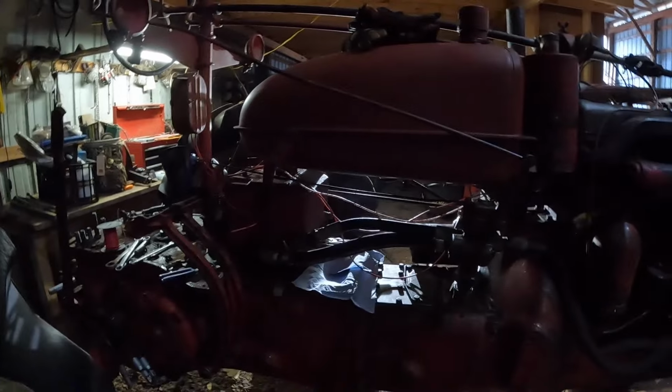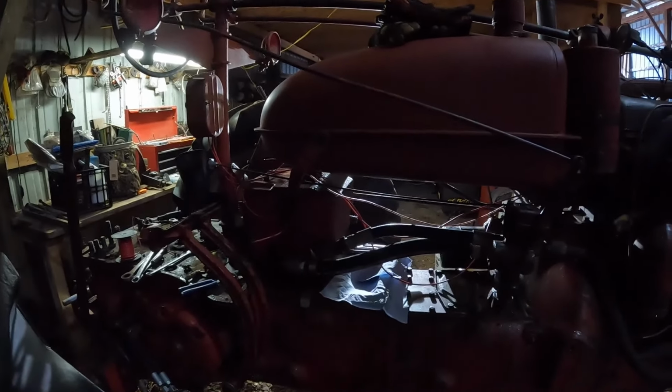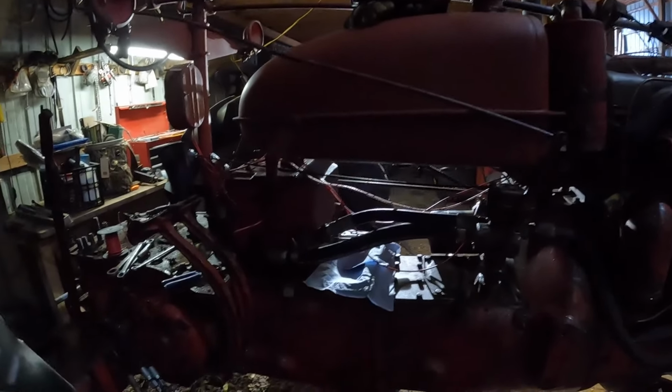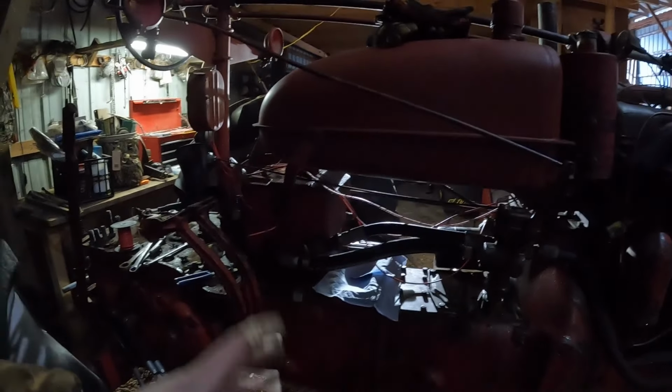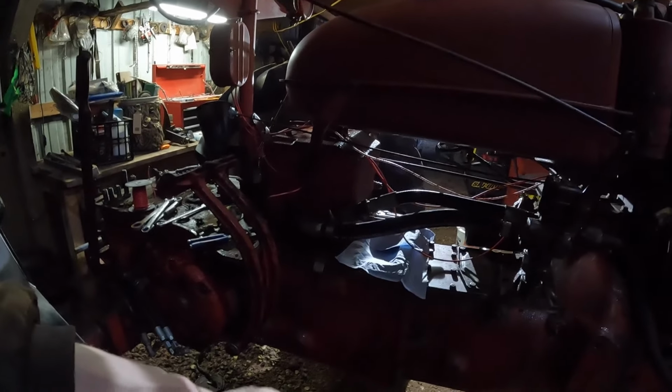What else? We did have to drain it drained out to where the hose leveled out, I guess. The hydraulic reservoir, so we're gonna have to put hydraulic fluid in that, which is probably a good idea anyways, because I don't know what it had in it, and it'd be nice just to put in the universal stuff that we're using and everything else around here, so that you don't have contaminated fluids and whatnot. Everything's universal and all the same, I guess, so to speak.